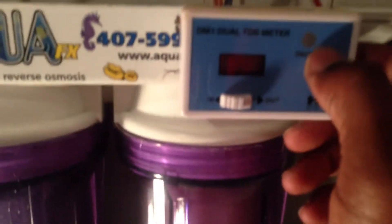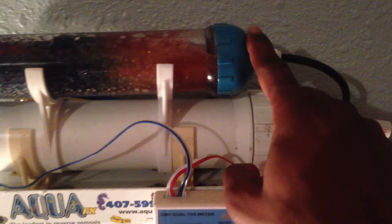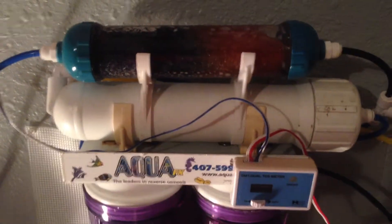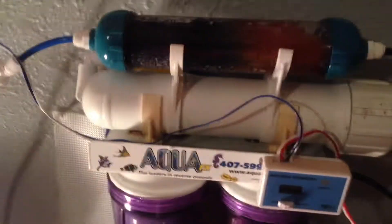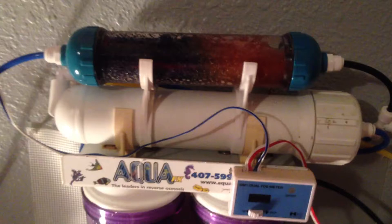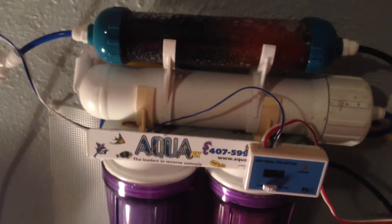Right now I can show you — it's going in at three, going into the DI at three. If your numbers are hitting like 15, 20, or 30, it's going to deplete the DI resin real fast. At three, I can probably run 100 gallons through with what's left and it'll still be useful. But if it's at 15 or 20 or some high number, 10 gallons is going to run it a quarter down and you'll just waste a lot. And this DI resin gets pretty expensive.